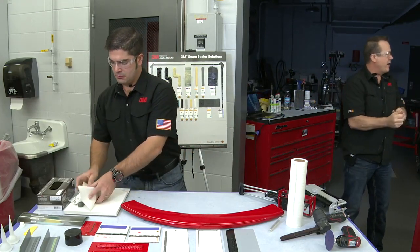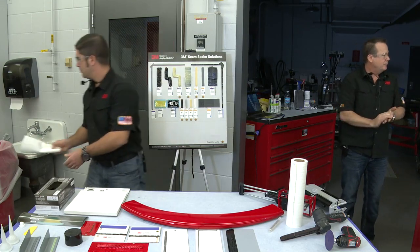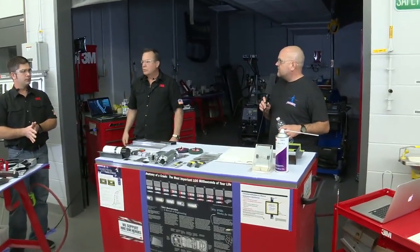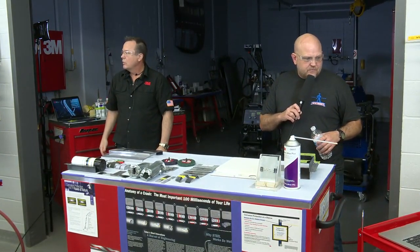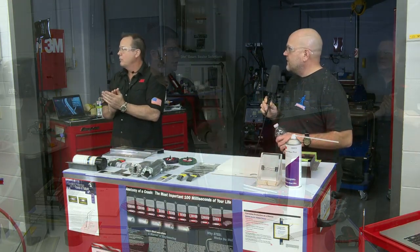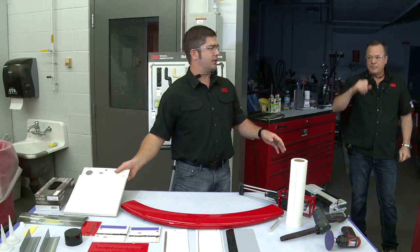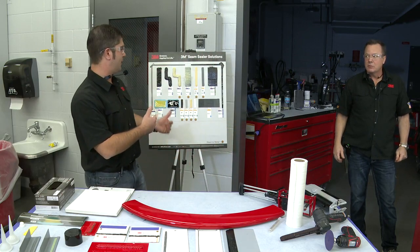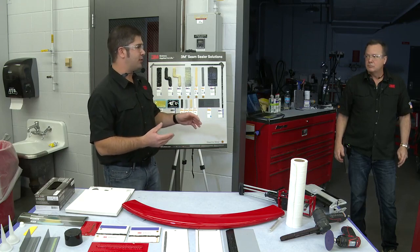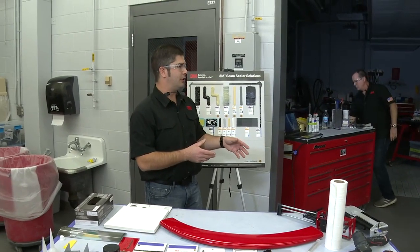Jason, when they say type of applicator, are they talking about pneumatic versus manual? If that question person could answer that, so you're talking manual versus pneumatic applicator gun? And then I guess there's different types of manual applicators. So I'm assuming they're trying to achieve a certain look or a bead texture. Maybe, if they can chime in on exactly what they're looking for, because there's a variety. You can see by the board behind me, there's a variety of textures that we can match using different applicators. So some of these, yeah, you have to use a certain applicator to achieve that look, right?